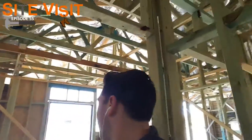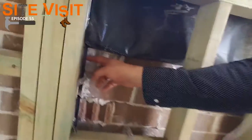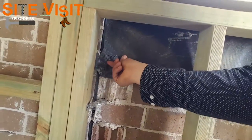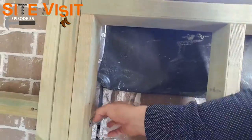Another thing we have here — I'll see if I can find a better one for you to look at. This is going to have to do. Next to the flashing, we've got the expansion joints. As you can see here, this is an expansion joint. Now the purpose of the expansion joint is to avoid cracking and put breaks in the brickwork. Down a really long run, they might put them every five or six meters, or put them on the joints of windows. They are put in certain spots, and then going around the outside you can see it on the black side, but they'll get siliconed over the top so they'll actually look like the mortar. You actually won't see them from the outside.